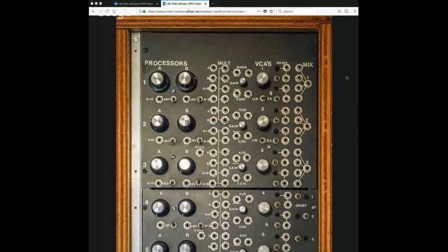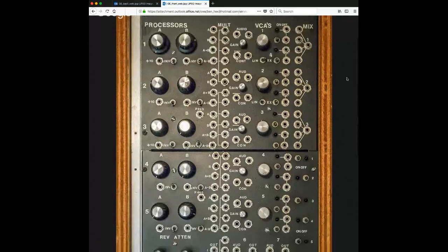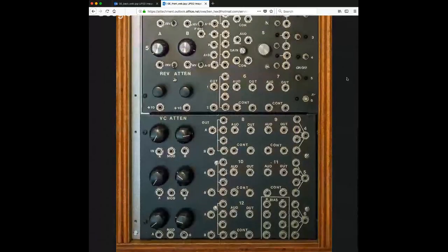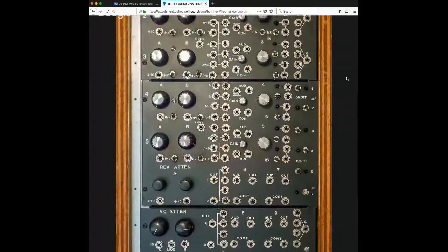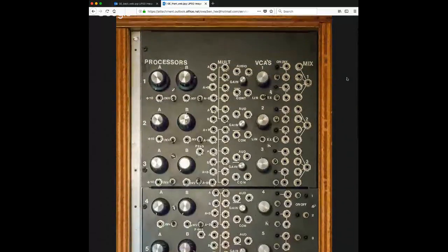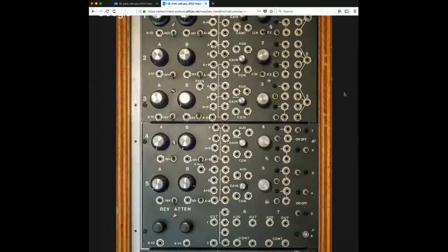Yeah, here is that system for anyone curious. I mean, it looks like a massive amount of stuff in terms of mults, mixing, VCAs, attenuation. Yeah, it's a great processor. It has lots of different mixers, including inversion. Plus 10-volt biases are normal to the inputs on all those. He's got voltage-controlled attenuators for processing control voltages, tons of VCAs, lots of ways of mixing the VCAs, mutes for the VCAs. He has intelligent summers that will actually cut the level down as you plug in multiple signals